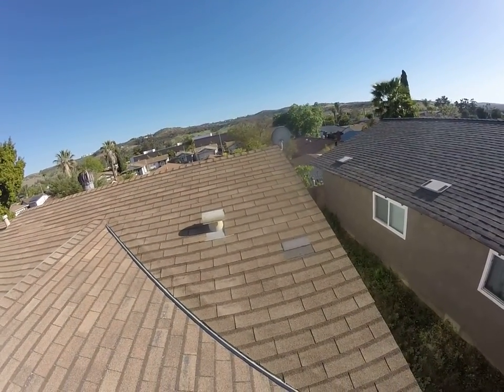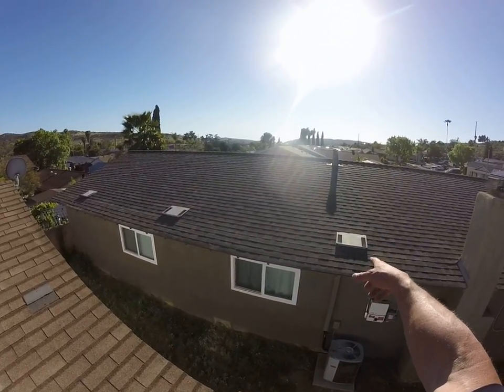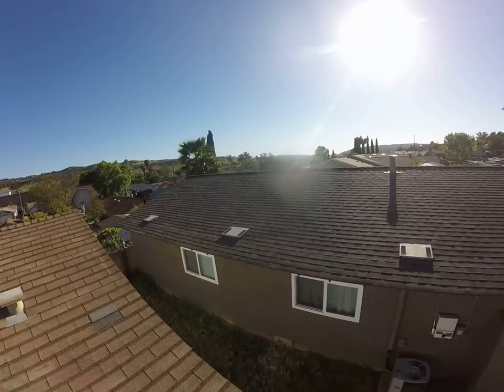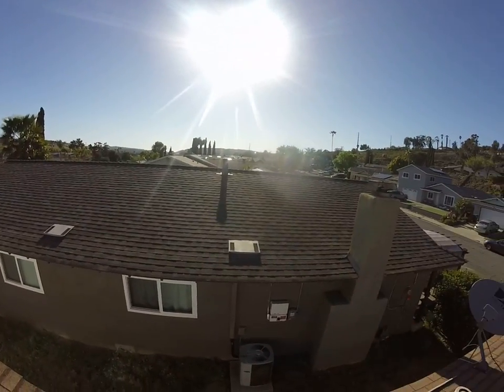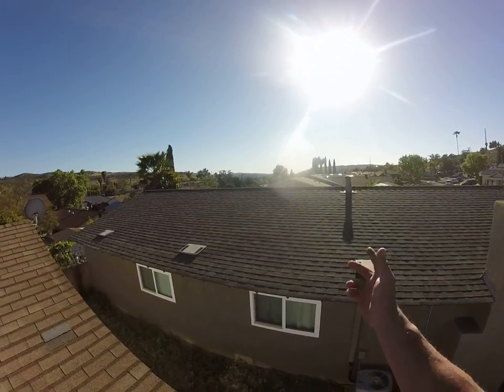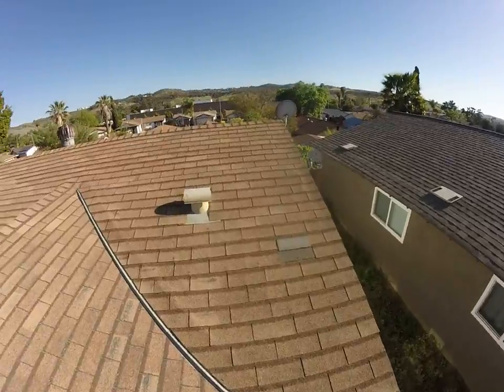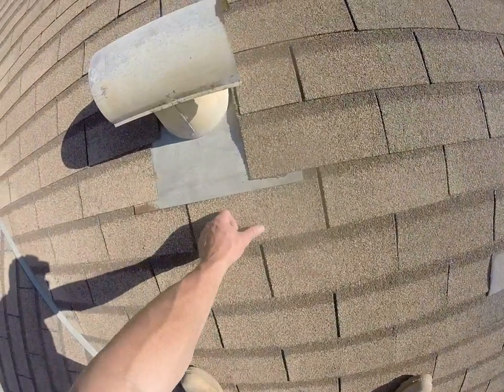On the neighbor's roof, that's a premium roof — it has these low-profile O'Hagin vents that allow cool air into the attic space, and then something across the ridge called a ridge vent that allows the hot air out. That is an excellent ventilation method to get the hot air out of attic spaces.